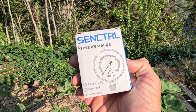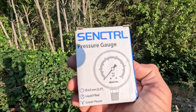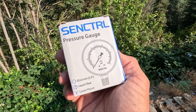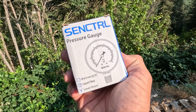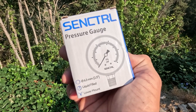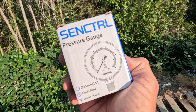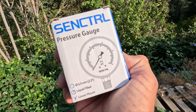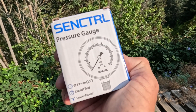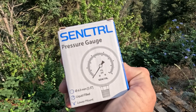This is the new pressure gauge that I'm going to be installing onto the ram pump. One of my commenters told me to try a liquid filled pressure gauge because the ram pump has a water hammer effect and it's constantly abusing the pressure gauge. The needle is jumping anywhere from 35 to 55 psi constantly, 24 hours a day, seven days a week. This is a new style pressure gauge that I'd never heard of or seen before — it's glycerin filled, so it should dampen the needle's bouncing effect and hopefully last a lot longer than a traditional pressure gauge.